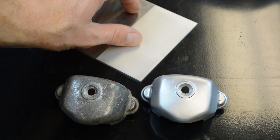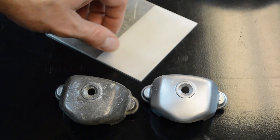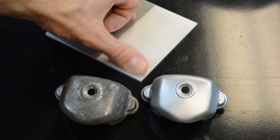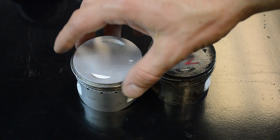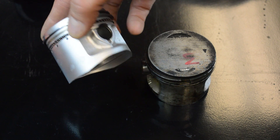This is really smooth, and I wish you guys could see this and feel it for yourself. This dry-blasted surface is porous, rough, and it'll stain — if I had a greasy finger, this would stain. This vapor-blasted surface, not so much. Over here we have a piston that we blasted — took again one to two minutes. It's completely clean. Looks beautiful.